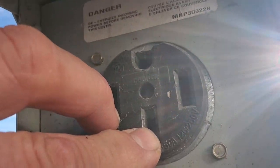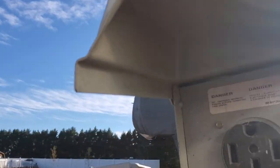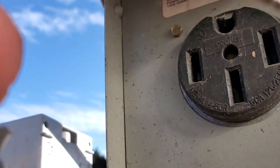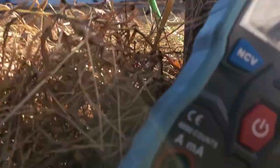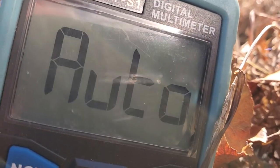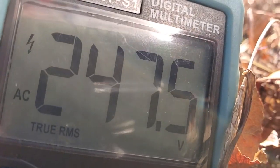So you would open this up, look at it, or go to the main breaker panel, which is in the garage way down there. I've got like 100 feet of wire coming out here. First thing I do is I measure both legs. See the length of that multimeter lead — it sticks down in where there's metal. Measuring leg to leg — 246 volts. 247, alright.